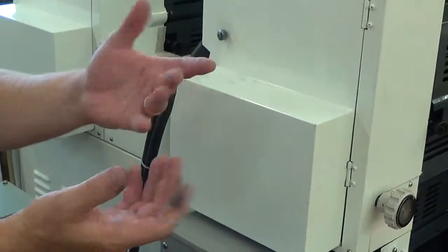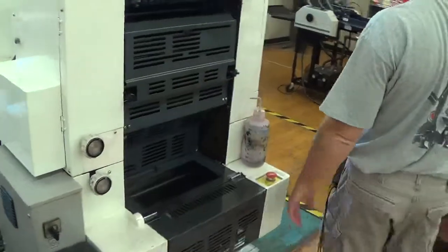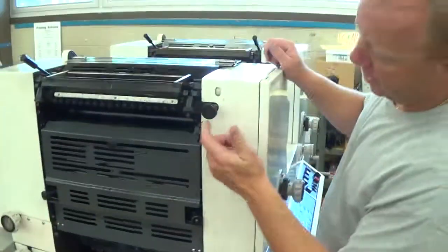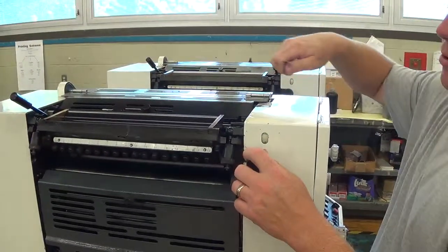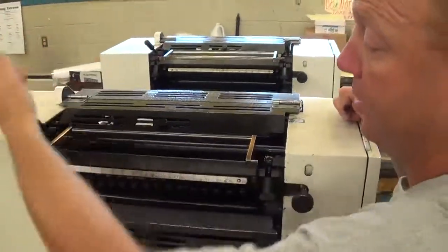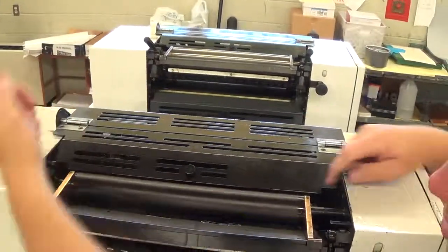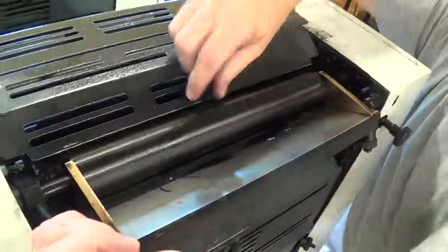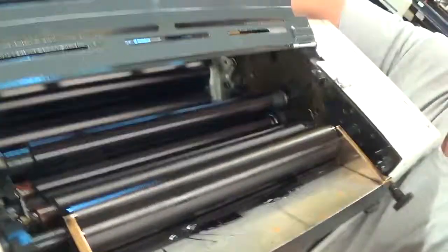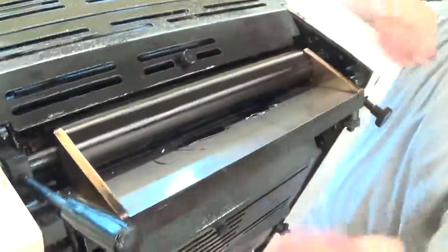I should have put some gloves on — it's a smart thing to do when working with this if you want to stay clean. My ink adjustment is set to a little less than five, which should be fine. It's our first run of the day and I did spray some preserver on here, so I'm going to get a fresh coat of ink by moving my lever back and forth until it starts to look nice and shiny — you can see it looks wet. It looks pretty similar inside, but that's because we preserved it. We should be okay and are about ready to give this a start.